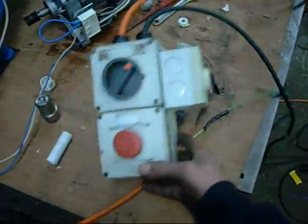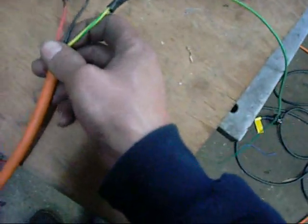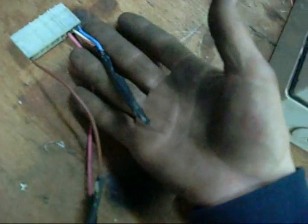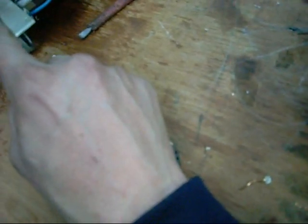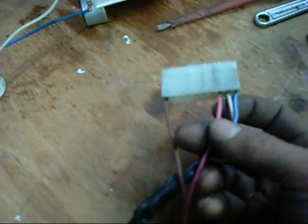The main control box is assembled. I still need to find an amp meter — I might bolt another box on the side for one. Before I wrap this into a taped loom, I'll show you which is which. One positive lead goes to the bottom terminal on the plug, the second single phase lead goes to number 3 from the top, and the two top ones are wired together. If you want to blow the motor up, you'd put power straight to the brushes — pins 2 and 3 — but that just burns the motor up and it doesn't spin.